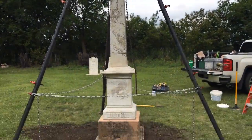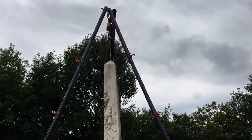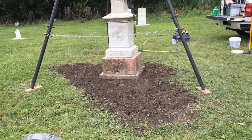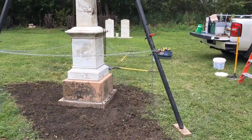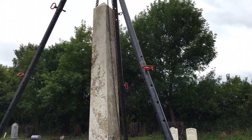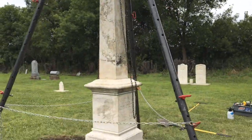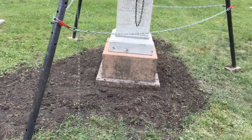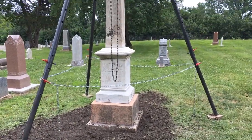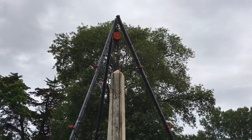From about that bottom base, it's about 10 feet tall. Right now the legs are spread equidistant at about 9 feet. The pin configuration I've got — I do have about 6 more inches of extension that we could go. But right now, just for reference, if somebody else is trying to build this, I can lift 11 feet.